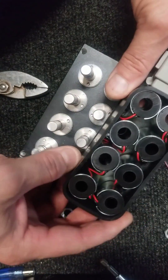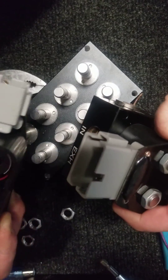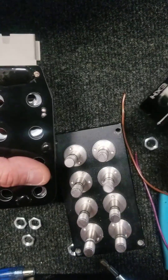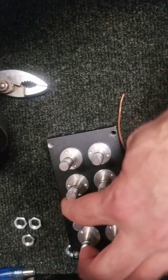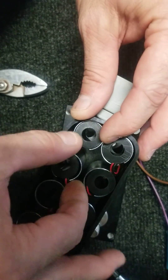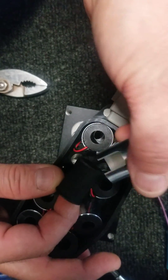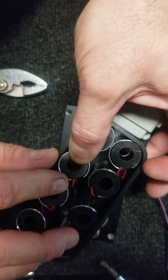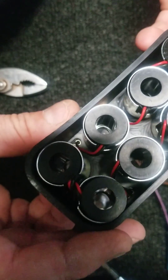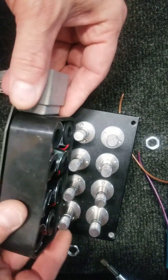When you put this assembly back together, make sure you've got it in the correct position — exhaust is to the right. Also, on the back side here you'll see there are metal sleeves around these coil packs. The sleeves have an indentation cut in them — make sure that indentation is pointing toward the wire so it doesn't wrap around and cut that wire when you seat everything down. That's a big deal; you don't want to short any of your valve packs out.